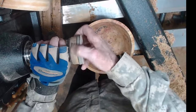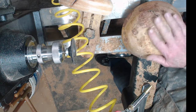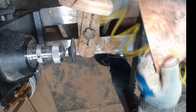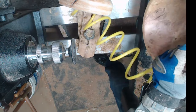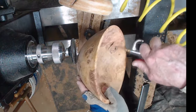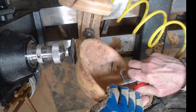I go through all the grits. There's a lot of dust — very fine dust — in a lot of crevices. It's recommended to vacuum nowadays to get rid of that dust, but I'm kind of old school and I just tend to blow it around my shop with an air compressor: into all the little crevices, blow it out before I put any finish on it, blow it inside and out, away from you. If you've got a dust collector, you can blow it toward the dust collector.